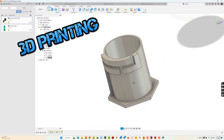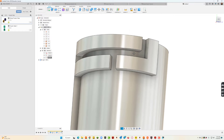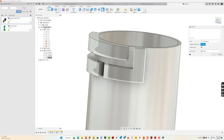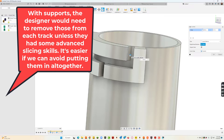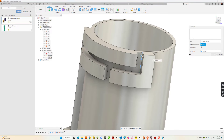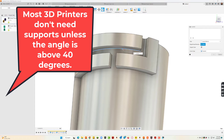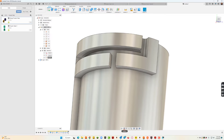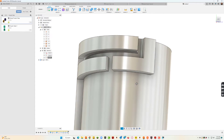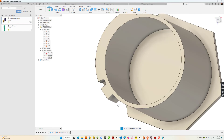Now here's something else to consider. Right now to 3D print that, to get up underneath here we would need some supports. To avoid that, here's what we've found: take the chamfer tool and create a small chamfer around the edges, making it uniform. I'll try 0.03, and then to make sure it will fit, do 0.03 on the other side as well. Those little chamfers do a couple of things — they're really there to help support 3D printing, but they can also make things move a little more efficiently. So just some thoughts to consider as you do the project.